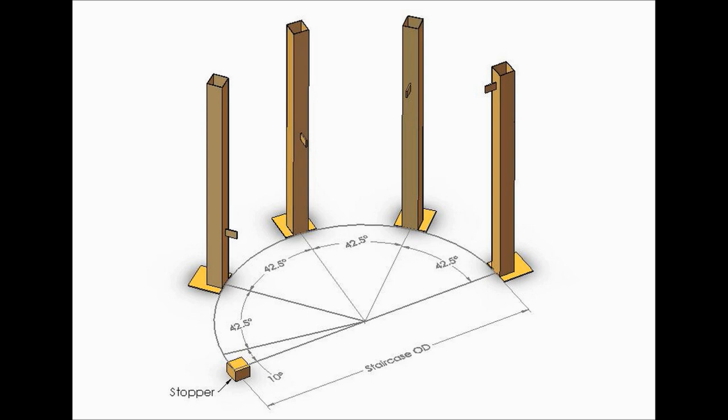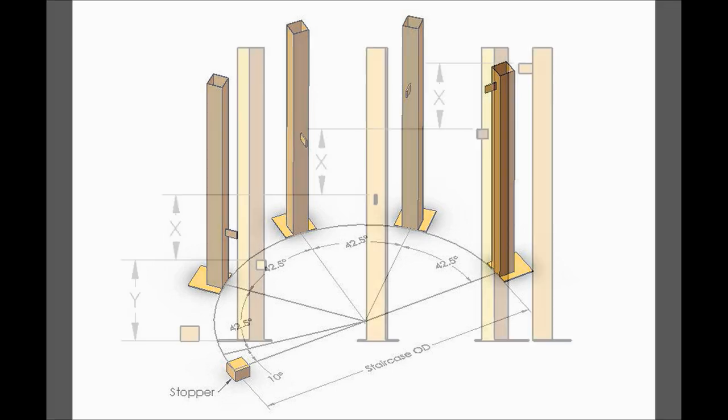Check your handrail as follows. Draw a circle on the floor and divide it into segments as shown in this drawing. The first 10 degrees are needed for the end of the tube, which will not bend properly. Then, set up square pipes and weld some supports or shelves. These support structures repeat the pitch of our handrail.